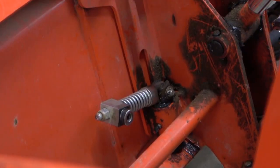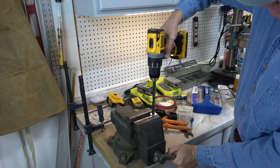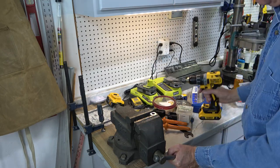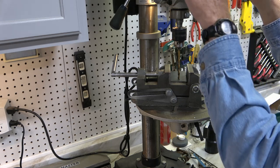In order to have room for the tab to move freely, I need to extend the pivot bushing by a little more than an eighth of an inch. It so happened that I had some 3/8-inch washers, 7/8-inch in diameter — just about the same as the bushing and a little more than 1/16-inch thick each. So I just needed two of them for my bushing extension, though I did have to enlarge the 3/8-inch holes in the washers to fit the pivot bolt.